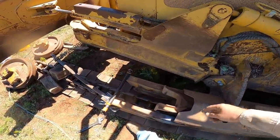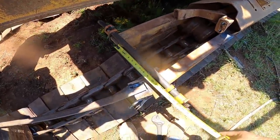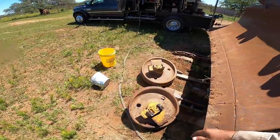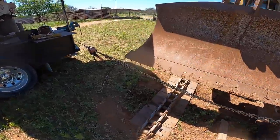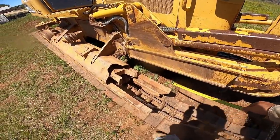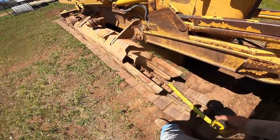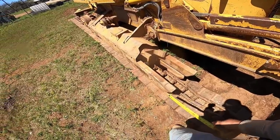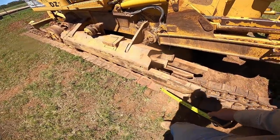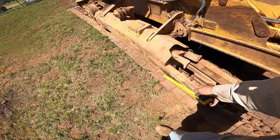This guy here has to come in, I forget, let me see, needs to come in about 1/2 inch. So same thing with the other side, it's going by 1/2 inch. Looking down the back side, this guy looks good here. It looks nice and straight, so we're going to use that as our zero mark. Once we go park the truck on the other side, we're going to put the same fork here and push inwards. And the customer told me they put a patch plate over this because the bolts stripped inside